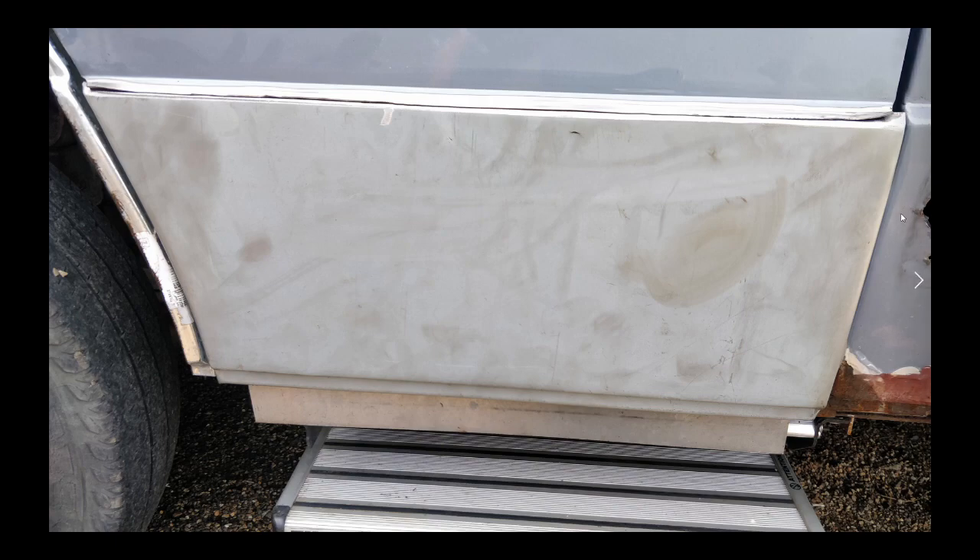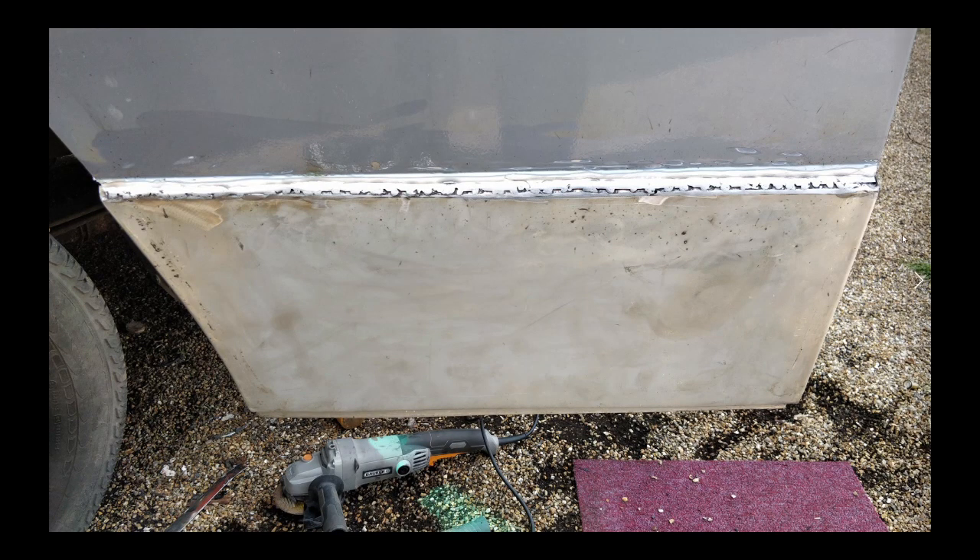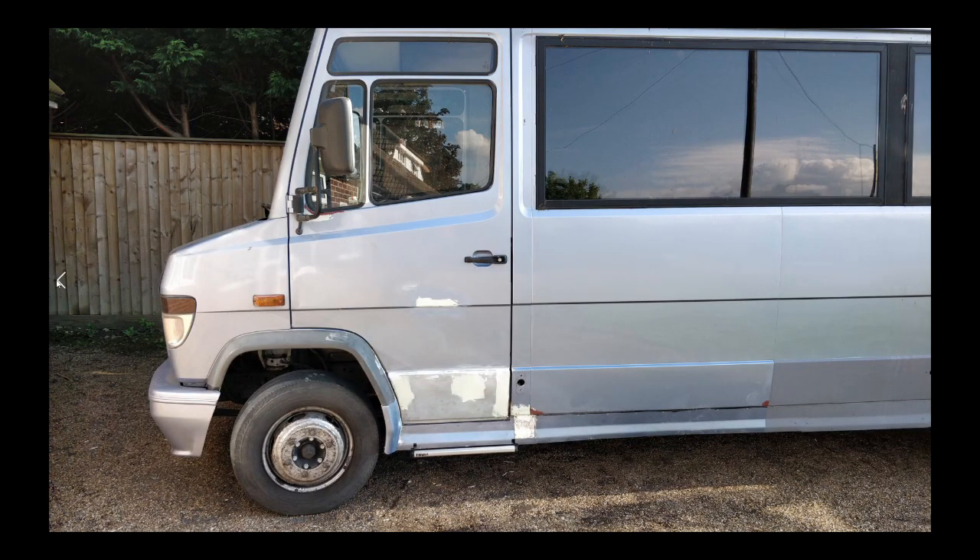So I had to do some modification — I cut it and bent it over again. It wasn't perfect but it did fit. I spot welded and puddle welded it with the welder, then ground it off with a flat wheel on the angle grinder. The rest of it I folded over and actually glued and folded it over to the lip on the inside. With a bit of filler on there, it looks quite acceptable. I've also trimmed it with a bit of fiberglass off-cut to make it look a little bit nicer.